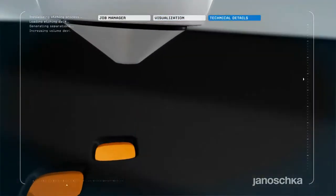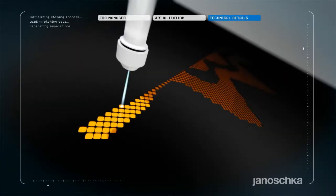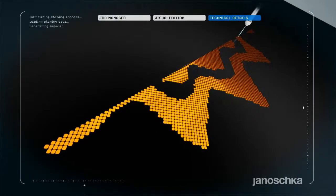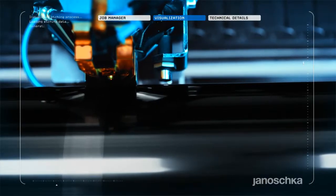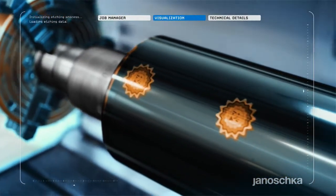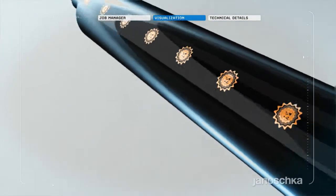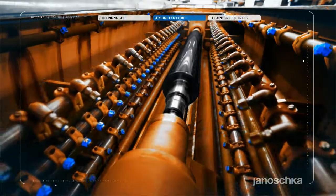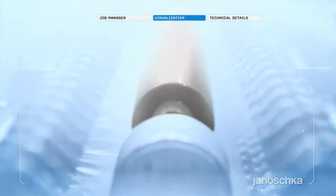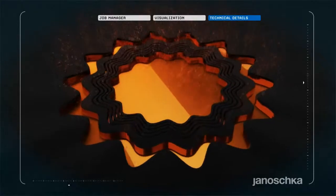The laser process reproduces the design onto the etching resist by removing it. The copper remains unaffected by this production step. Etching is a chemical process. The cells are etched onto the copper layer by means of an etching solution, which is the ferric chloride. This is exclusively possible on those spots where the etching resist was already removed by the laser processing.